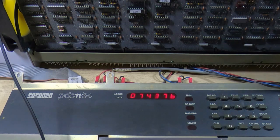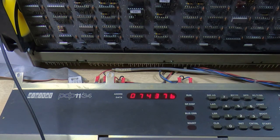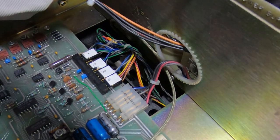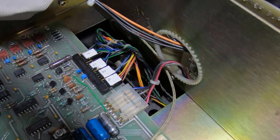The drive was doing more interesting things during that process. Looking down into the system, you should see the head carrier moving, and instead of going once and then resetting like it did before, you should see it going through several sectors. Running it again — hopefully you could see it was actually going through and reading several sectors, which is kind of what you'd expect to see during a normal boot cycle.